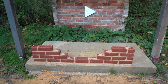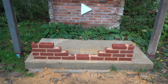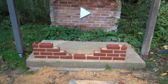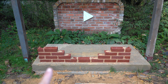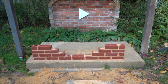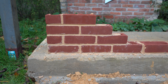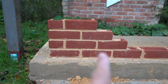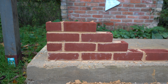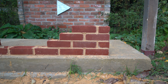Before we get into the video, I just want to take a quick minute to talk to you about perp sizes. I've built a couple of rackbacks here — in the following video I'll show you how to build these; they're essentially the same as corners but without the return. If you look at this side, all the joints are perfectly 10mm and very nice. The ones on this side are bigger — between 12 to 15mm. Taking a closer look, you have to ignore the scrappy bricks on the bottom courses as I've reused them. That side looks quite nice in terms of perp and bed size. Over here, I haven't jointed this up yet because it's still a bit wet, but you can tell the joints are much bigger.